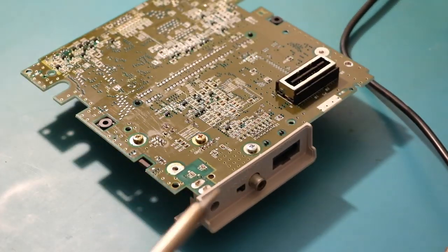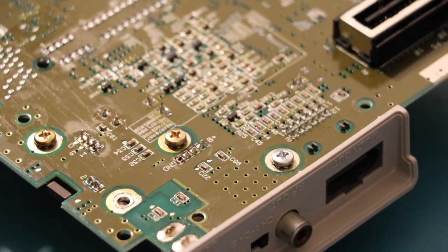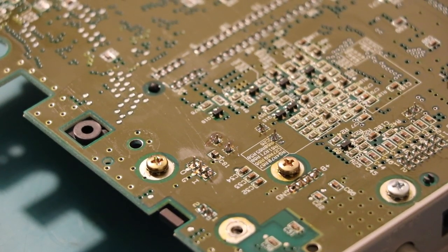And then once that's in, all you need to do is really just add more solder. Obviously solder the two other legs. Otherwise you're not going to get any power.